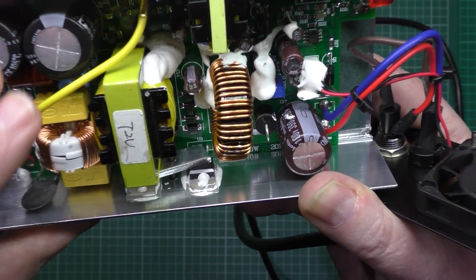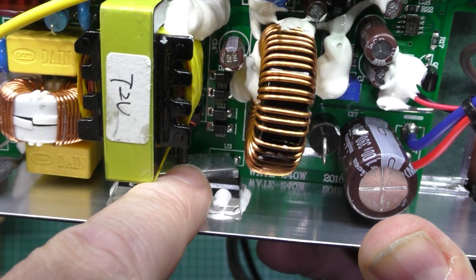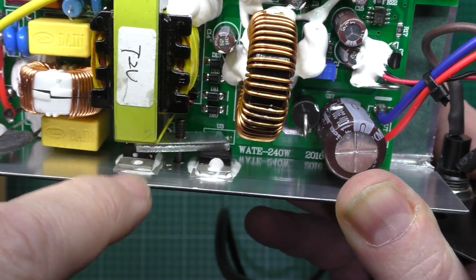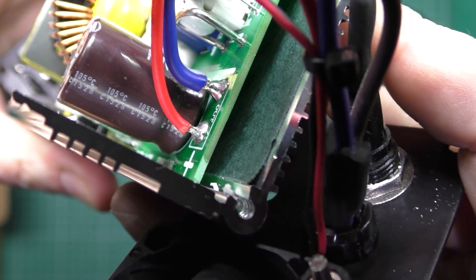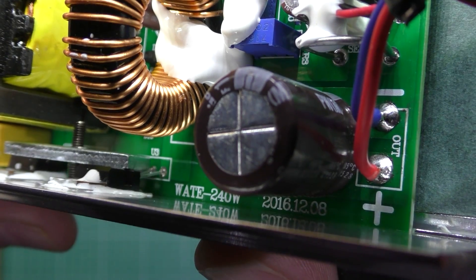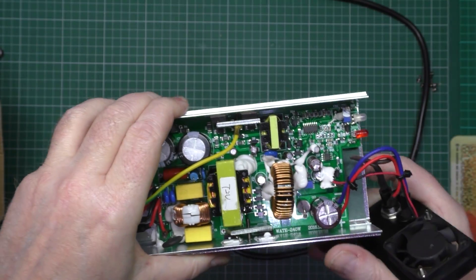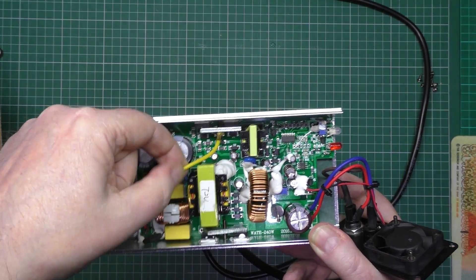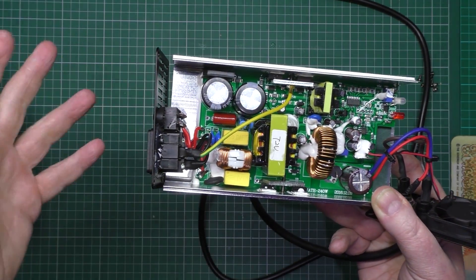One thing I noticed — and it's one of the reasons why I always take everything apart — is these retainers here that keep the FETs onto the aluminium housing. It's actually touching one of the legs. So that's why I take things apart. On a positive note, it's nice to see they've actually attached the earth wire to the casing, just in case something goes short and it doesn't take your arm off and kill you.